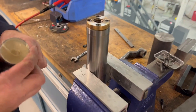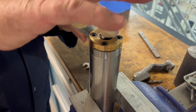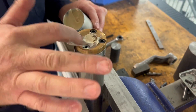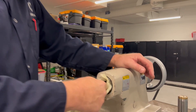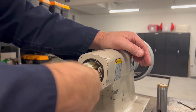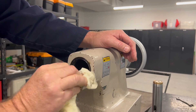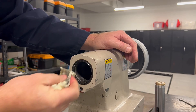After I've blown it out, I'm going to take some fresh lithium grease and schmutz that into the threads. Before I reassemble it, I'm just going to take the opportunity to wipe the bore out and make sure the bore is clean, and make sure the seal is clean. This stuff is always being bombarded with chips, so it's a good opportunity to clean it out.